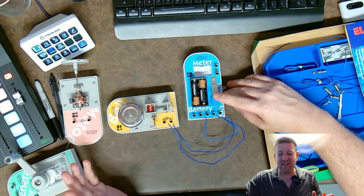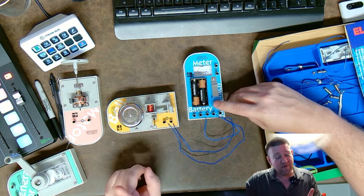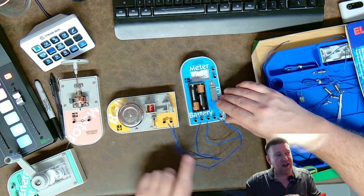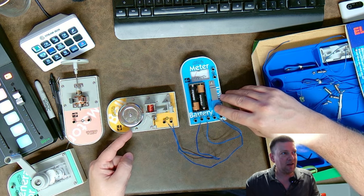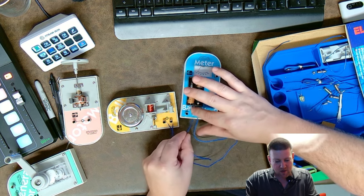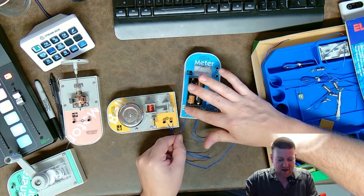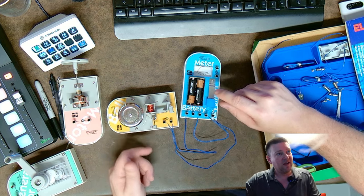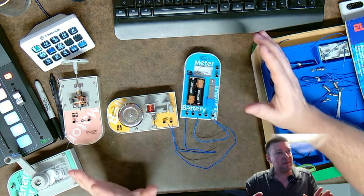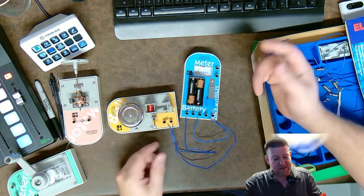My kids love the bell — anything that irritates the parents, the kids love. If I run this on 1.5 volts, there's some sort of capacitance effect — it vibrates for a second and then staves off. Hooking it back to 3 volts it rings fine, then back to 1.5 volts it moves briefly and stops. There's not enough energy to maintain the magnetic field on the coil to keep drawing in the spring arm. Maybe it's not capacitance at all — maybe the battery just gives its most and then stops. Those are brand new batteries, by the way.